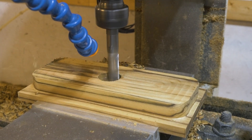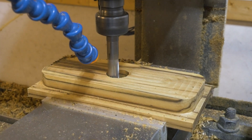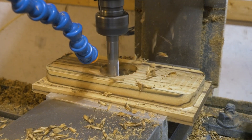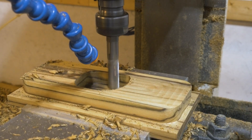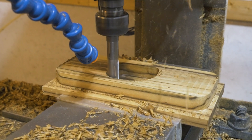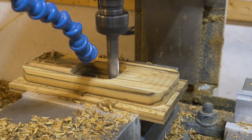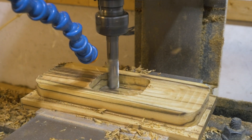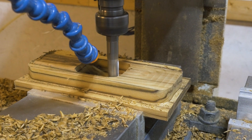This is a six degree ramp down — I never do that in metals, it's always one or two degrees depending on the tool. And all these feeds and speeds are the same. Again, this is going down like three quarters of an inch. The PM30 is also great for metals, it's just a lot slower. You can make really accurate, really nice parts, and if you're making parts of steel that don't require a lot of material removal, that's where this mill really shines.